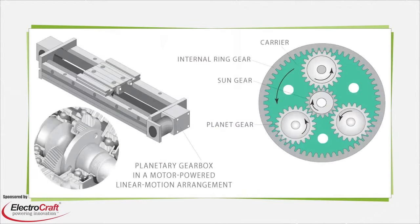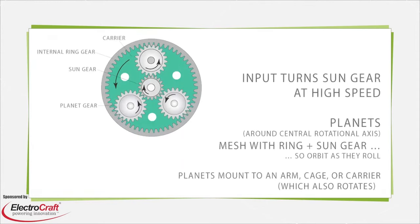The simplest planetary gear sets engage three gear types. Planet gears revolve around a sun gear that spins in place, while a ring gear — often a fixed gear machined to an inner assembly surface — contains the planets. Concentricity of these gears' orbits makes for torque transmission through a single axis, allowing for a compact design space and simple integration.